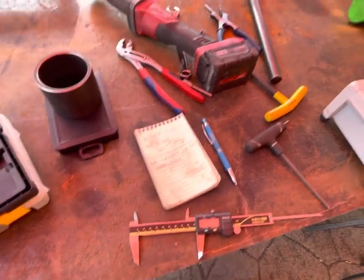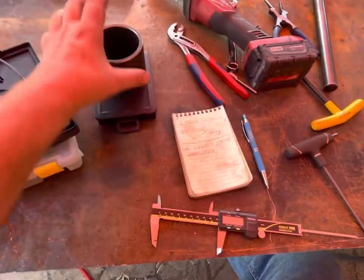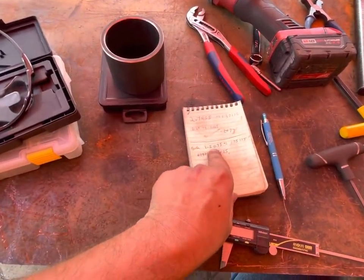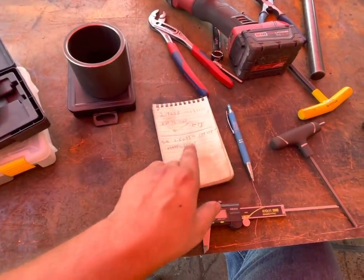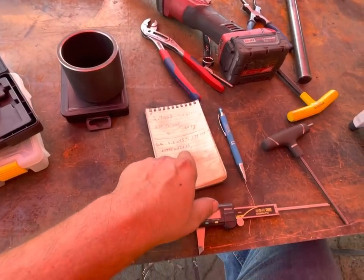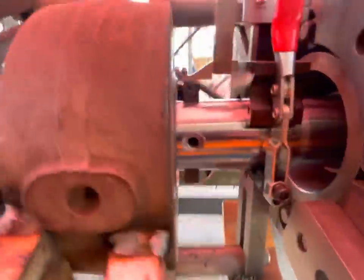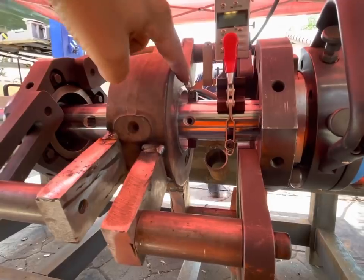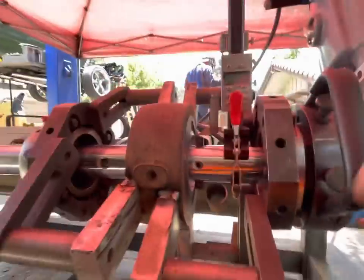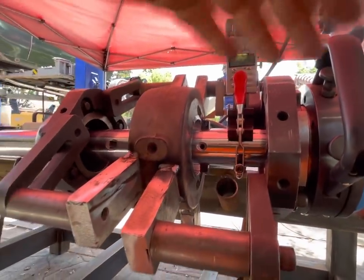Some of you might want to know how I do my tool adjustments. So I've used micrometers to measure the OD of my bushing, which is that number. So I took off 5/1000ths for a crush fit, divide that in half, get this number, minus half of the bar, 1.125, and that will give you how far the tool bit tip would need to stick out from the bar if it makes a full rotation. That would be the correct size.